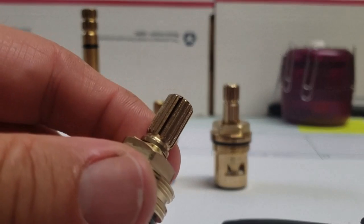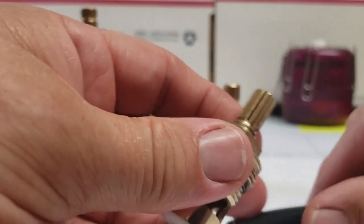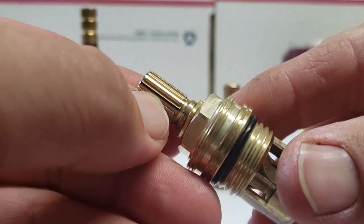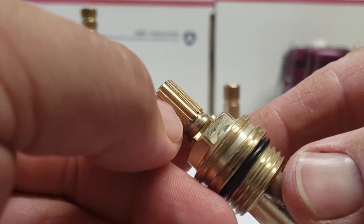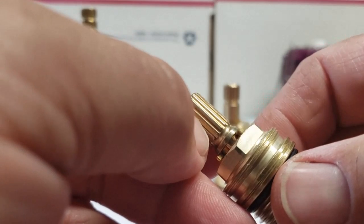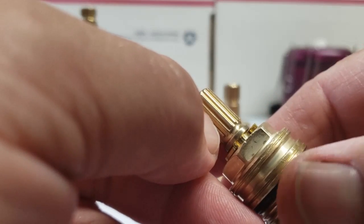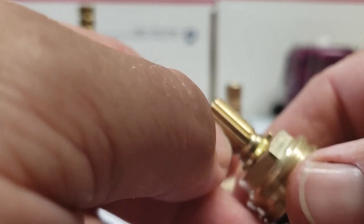Get a little black line on there, then take your thumbnail and start — that one is number one — and then go to number two, three, four, five, six, seven, eight, nine, ten, eleven, twelve, thirteen, fourteen, fifteen, sixteen, and then we're back to the black line again. That's the easy way to find that sixteen-spline count.